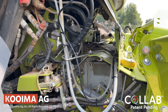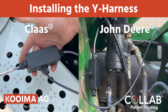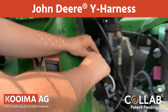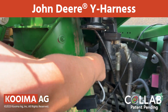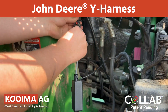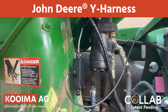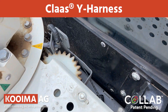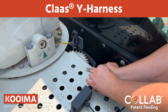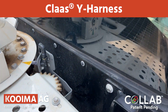Finally, we will run the extension cable back to the other side of the cab through the weatherstrip and into the cab. Step 5: Installation of the Y harness in both John Deere and Claas. For John Deere, the Y harness plug will be inserted into a housing on the bottom side of a black cast housing that is connected to the spout ring. Inside the maintenance area, you will unplug the default John Deere plug and insert the opposite ends of our Y harness into each side. For Claas, it is the same except instead of under a black housing, there is a plastic gear on the right hand side; on the underhand side of that plastic gear there is a plug that you can remove and then insert our version of the Y harness into the corresponding receptacles. From there, we can route the cable into the cab.